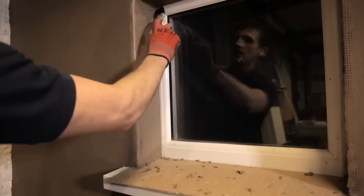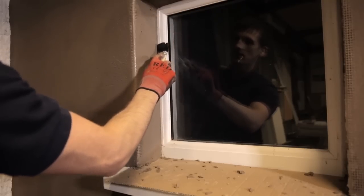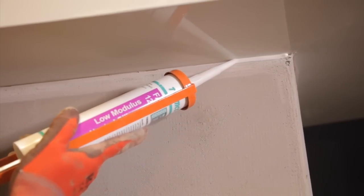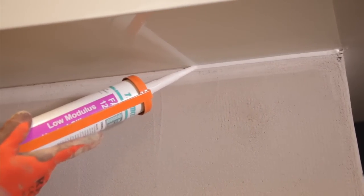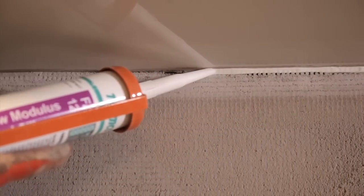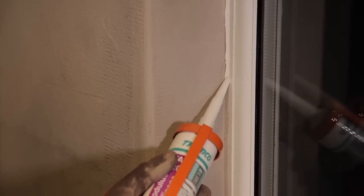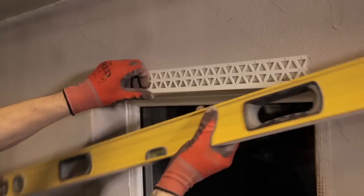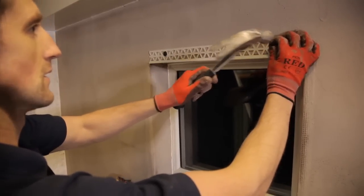Use a paintbrush to clean interfaces with the window and sills to prevent unsightly staining. Once the reinforcement coat is cured, apply sufficient silicone mastic sealant to all interfacing junctions to prevent water ingress. Cut surface mounted external corner beads and fix to the opening reveals and corners with plastic fixings at 300mm centres.